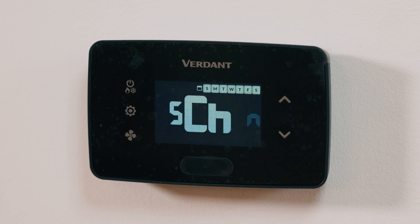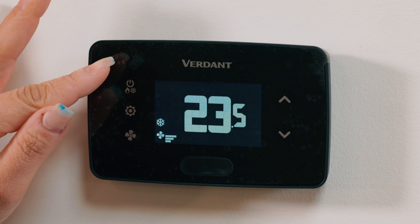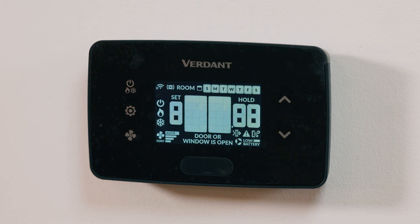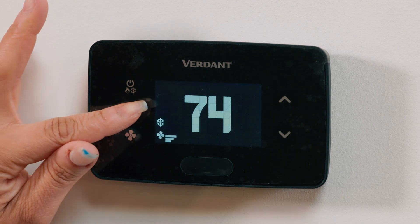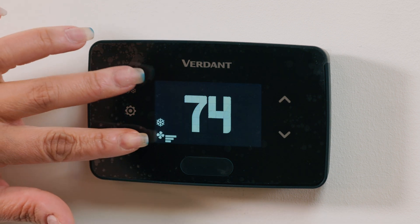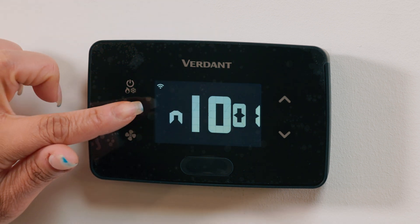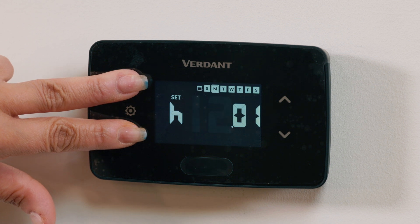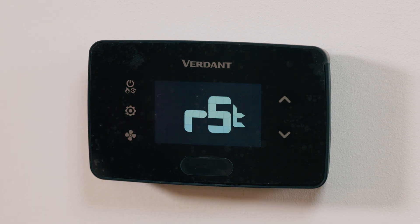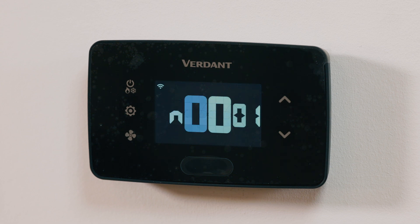For the scheduler, you can choose yes or no based on your needs. When you get to the schedule settings, you can always say no if you don't want to use the scheduler. The symbol for it is N. Press the system mode button, also known as the power button, to save. Now let's change the temperature display, depending on whether you want it to be Fahrenheit or Celsius — tap the settings button. To reset the thermostat, press and hold the power and fan buttons until the mesh ID appears. Then press the settings button four times to reach the time screen. Press and hold the power and fan buttons again until RST appears on the screen. Finally, press the settings button. The mesh ID will display as 0-0-0-1, indicating the reset is complete.